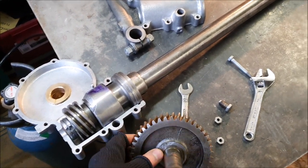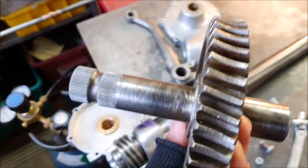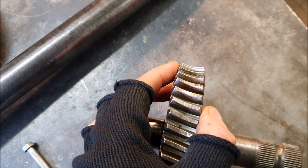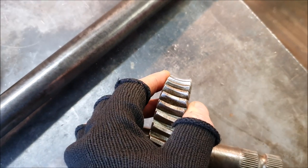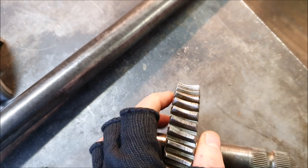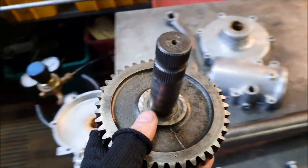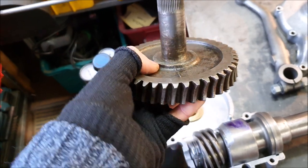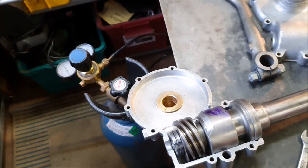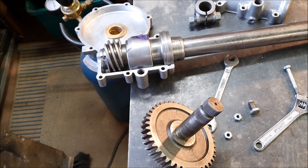Before I do that, it's worth pointing out that the main gear here can be put in any position. If you look carefully at the teeth on this, you should be able to see where it's been worn, where the gears have been meshing in the past. Some of the teeth are shiny where they've been worn. The entire rotation of the gear isn't used in practice, so what I'll do is rotate this gear wheel so that an unworn part of the gear is meshing with the worm — that should give me the best fit-up of these parts. Once I've done that, I'll bolt the housing back together and try to adjust the meshing to get rid of the backlash as best I can.